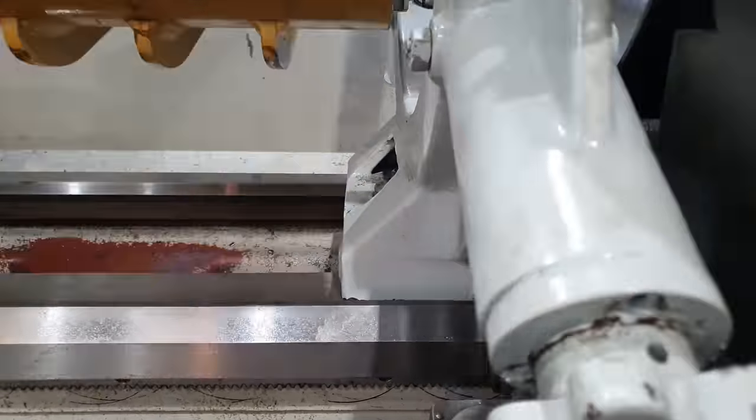Wow. So that's tight there. That's not good. It's 2 mil out of round. So that there is a machine face, so the wiper seal goes there. And behind it is the pressure seal. That is 2 mil egg shape that way to that way.